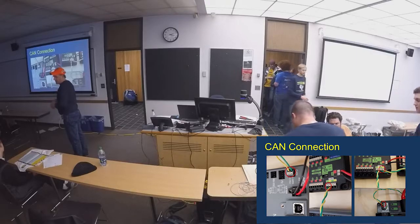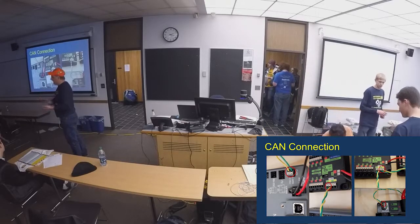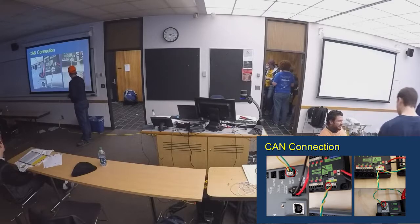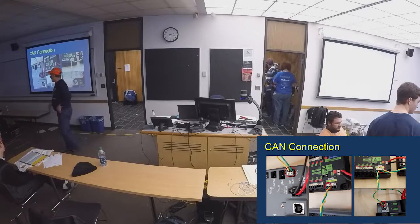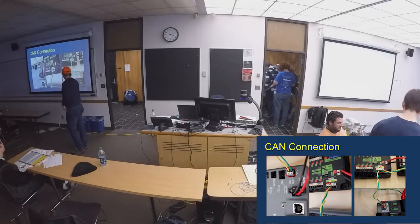You can go to different manufacturers and purchase little CAN bus splitters, and they'll have them integrated. But if you don't, and you can't communicate to your CAN bus, and you can't figure out the wiring with this jumper set to off, you won't be able to communicate with anything on the software side. So I recommend using it — it's easy, it's already available, you just need to make sure the jumper's on. Quick and easy to do.